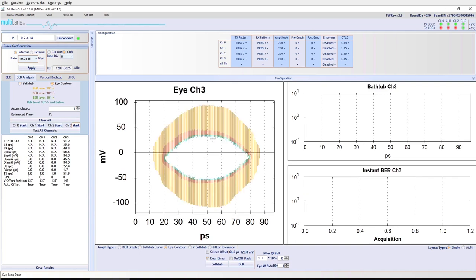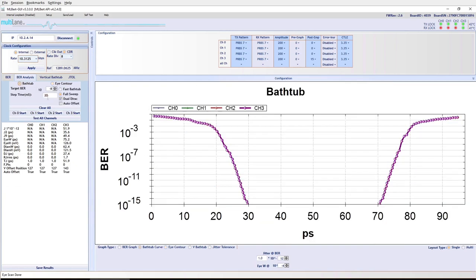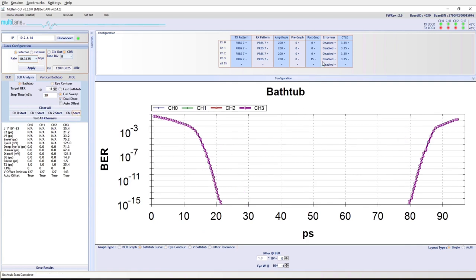Here's our eye measurement — we're just looking at the opening of the eye since we're sampling raw BER. Let's see if we can open it up by playing with some drive settings. About 10–15% on the post-cursor tap seems good for this channel. Grabbing another eye with those settings shows a pretty significant improvement. The bathtub looks significantly wider as well. So just a small change to the driver made a huge difference in this lossy channel.